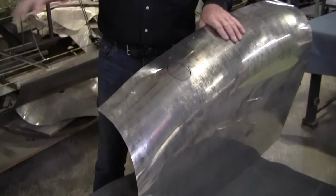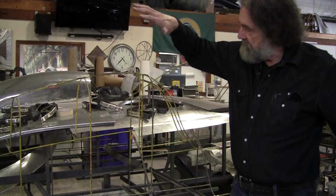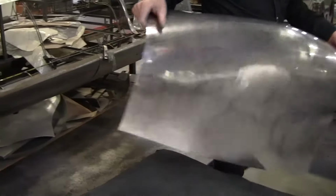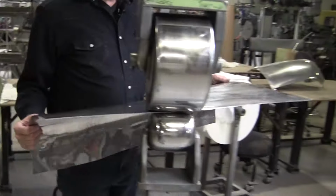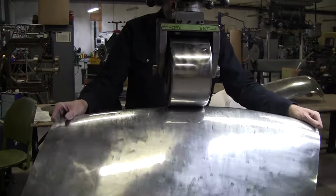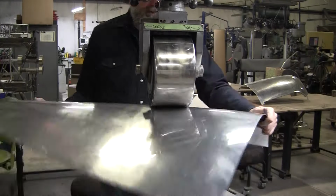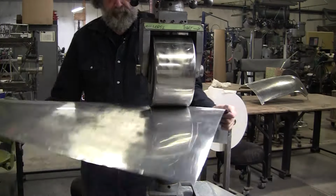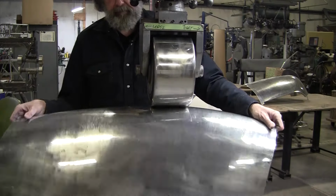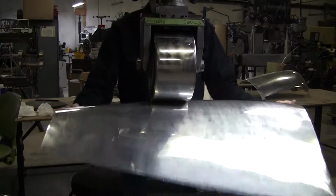Mostly what we've been doing is kind of fitting it this way. But then we will start fitting it this way and this way at those different angles. So we'll wheel this instead of hammering it this time. I could have malleted it, but I'll just wheel it. When you wheel it, the panel will shine up. When you mallet it, you get a mottled look to it.